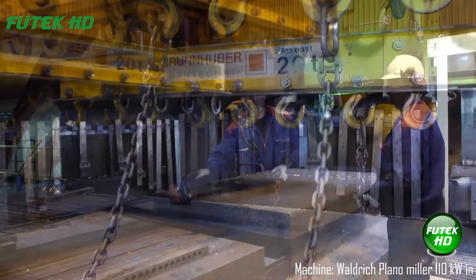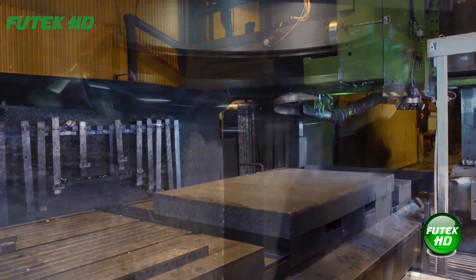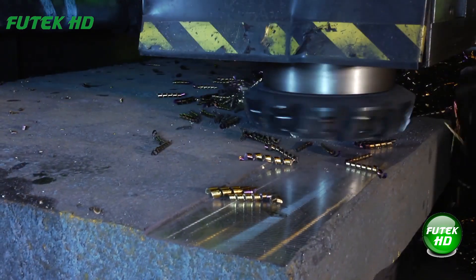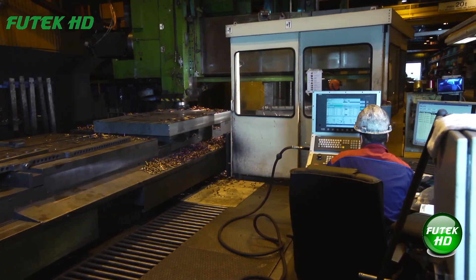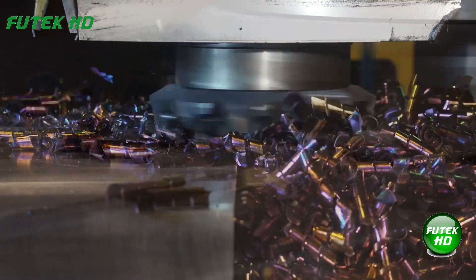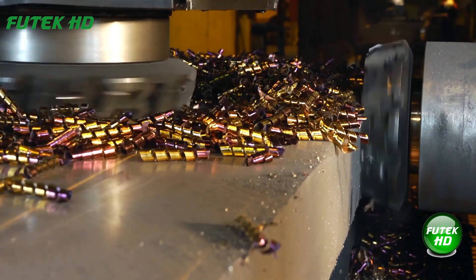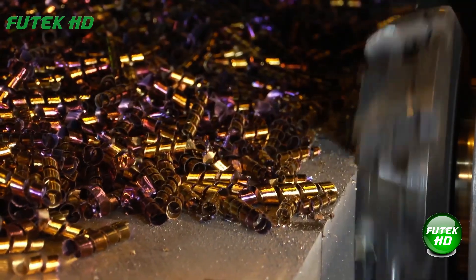The Waldrich Plano Miller, rated at 110 kilowatts, is a heavy-duty milling machine designed for high-performance machining tasks. In this operation, it is used for rough face milling of a high-alloy special steel plate — specifically IMPAX HH with a tensile strength of 1180 N/mm², SMG6. The operation involves machining a plate with dimensions of 2000 by 1200 millimeters. The cutter used is the R200-20.608315 model, with a diameter of 315 millimeters and 12 cutting teeth (Z=12), with SPEN-2807ZETR-R200 2.5 CVD-coated inserts for enhanced durability.